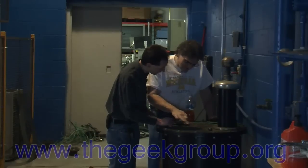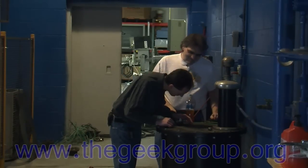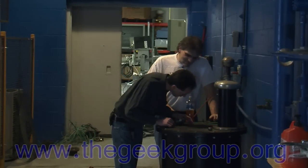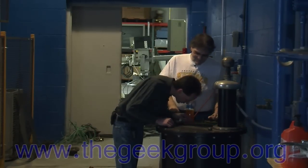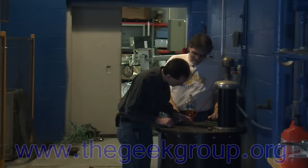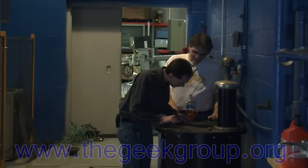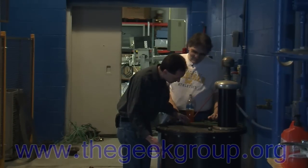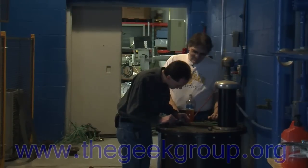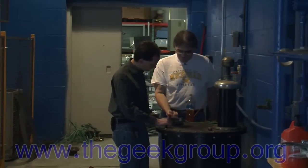For those of you following along that want all the numbers, it is a General Electric transformer. Model number C252684. Its form is EW. Its type is K, 60 cycles, 75 kVA, 1 hour, 75,000 volts output. And the primary side, the input, is 460/920. So I'm guessing that's by changing these around? Yeah, you put that one there.